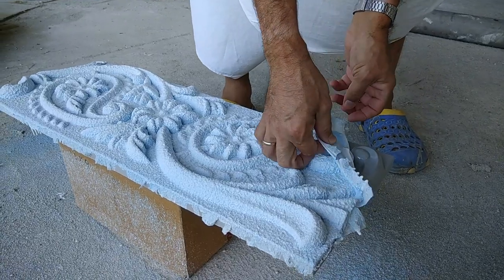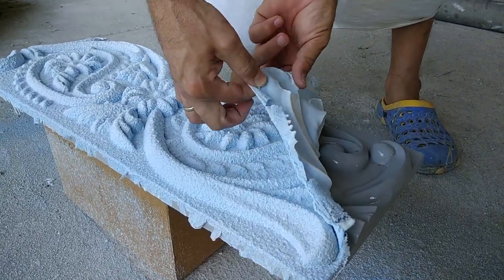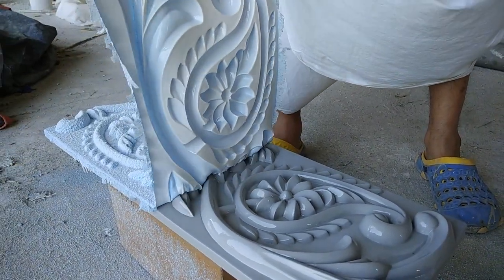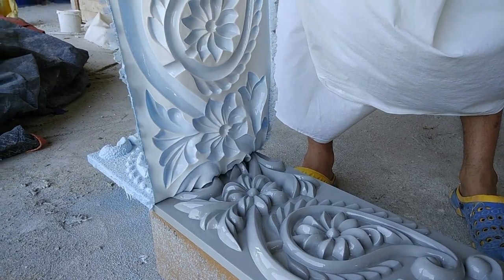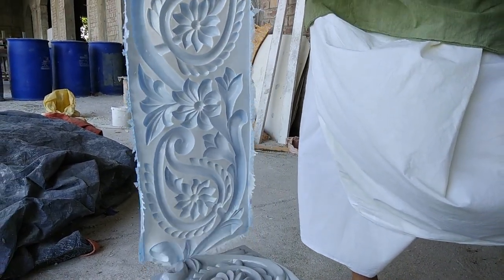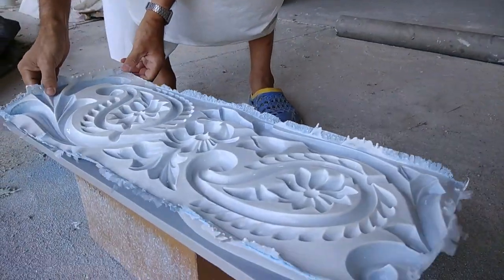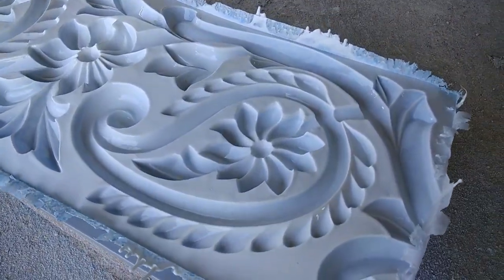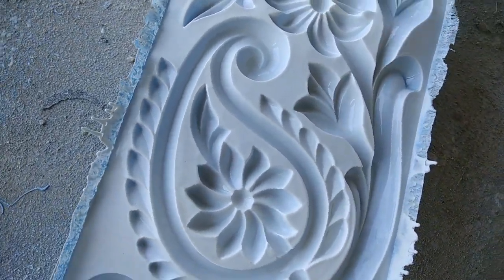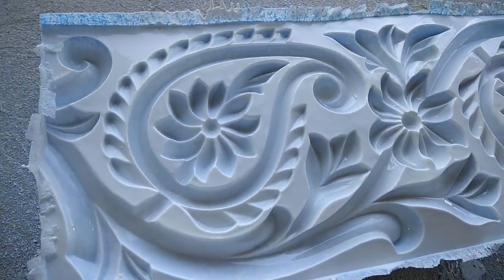With the silicone, the silicone material is so good that it does not require any release agent. We just take the dry silicone mould, spray gypsum into the silicone, and the next day — in 2-3 hours — we pull it out. Then we can paint the gypsum ornaments with paint directly, without de-greasing, without de-waxing, without cleaning.